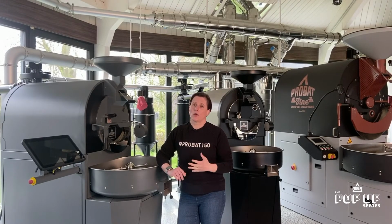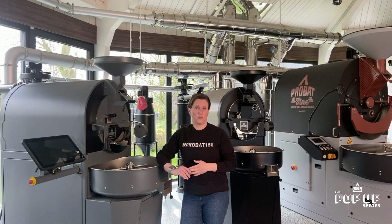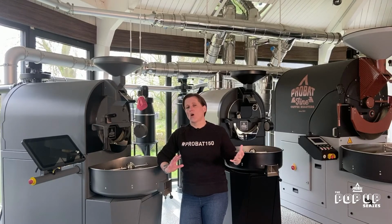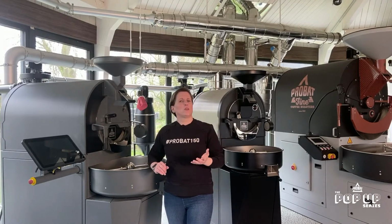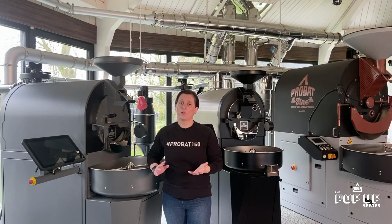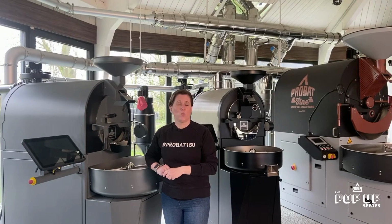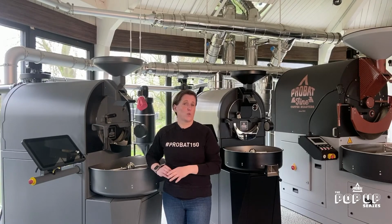When we talk a little bit more about machine size, it's important to understand that you have to have a certain height of your room, and also that the room has the right size. As our roaster works with fresh air coming from the room, you have to be sure that there is always enough air in the room so that the roaster can work with it, but you're also able to get enough oxygen while working with the machine. It's also possible to place the roaster in a location which is a little bit smaller, but then you need to be sure that you can open a door or a window, so that there is always enough oxygen inside the room when you roast, especially when you have a small cafe where you place the roaster, and there are also people coming in to have a drink or take away coffee.